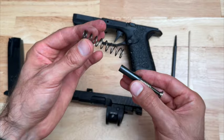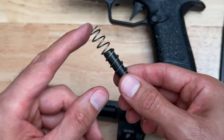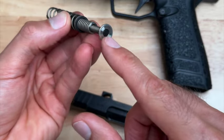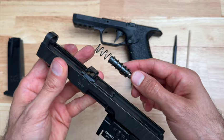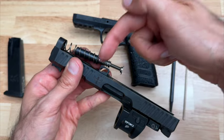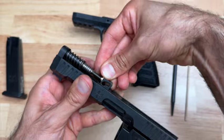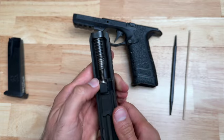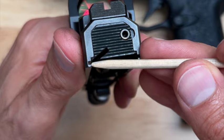Now we can insert the recoil spring. If the spring came off your guiding rod, just slide it back on — it doesn't matter which side goes on first. Take this part and insert it into this area. You're going to try to get this round part locked behind this flat piece — that's the goal. Insert the spring into the hole, compress the spring so this piece gets past the flat part, then push downward. Make sure the guiding rod is straight — not too far left or right. It should look like this.